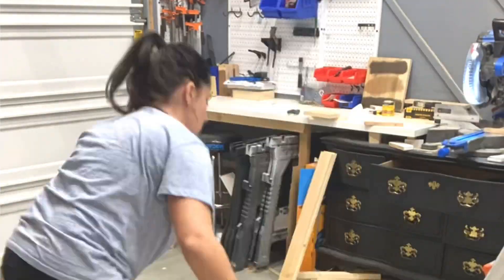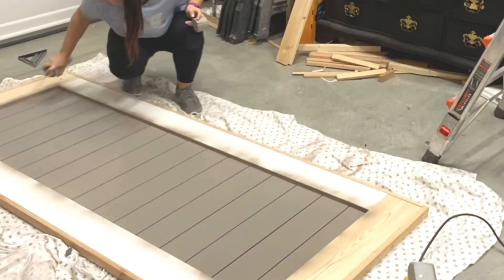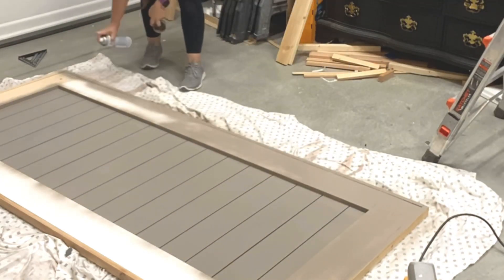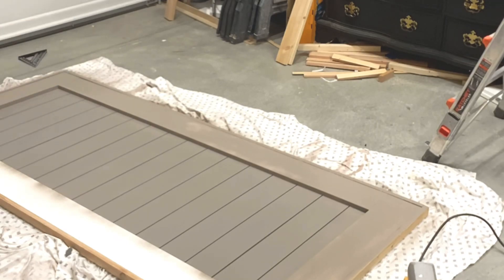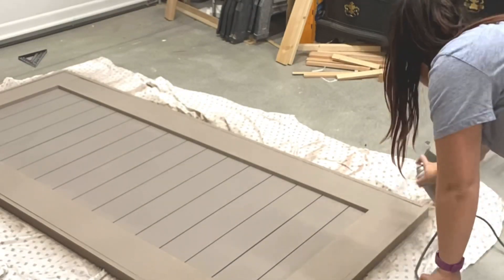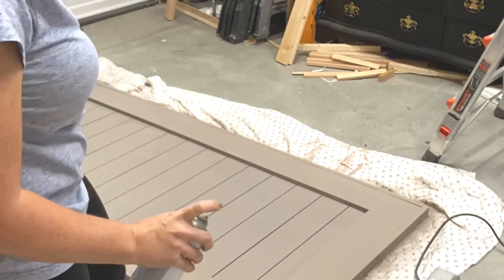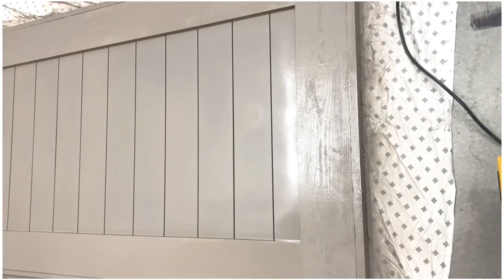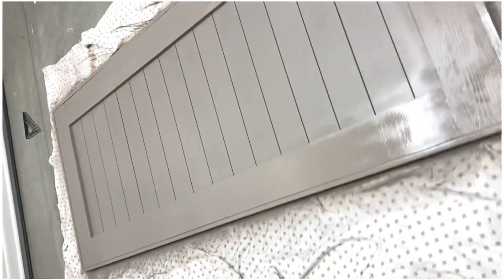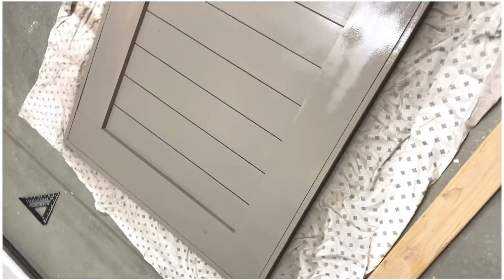Next, I'm sanding around the outside and the face, and then I'm going to go ahead and finish painting the face of the door. I'm using some spray paint — I love the color, I'll include it in the description. Now since this door is hanging outside of a closet, I am not going to finish the back — it'll just be an unfinished back. But if you needed it to be finished, you could use some really good sealer and primer and do those same final steps to the back as well: seal it, and then paint it.